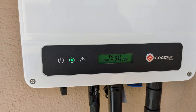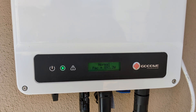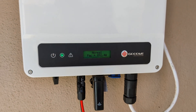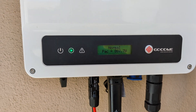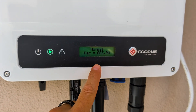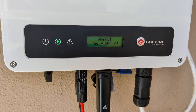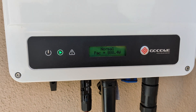The panels are at about 75 degrees so I can measure the power we can produce when we want to have space in a garden, backyard, or balcony to see if it's worth it. What matters for this video is that we are producing this energy, and if I didn't have the Deye micro hybrid inverter, the surplus — about 400 watts of power at this moment — would go to the grid and be wasted.